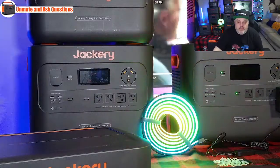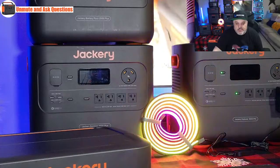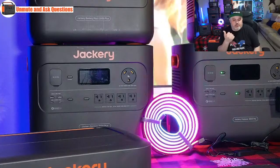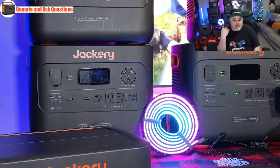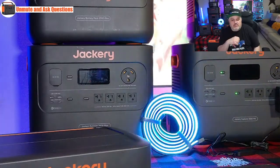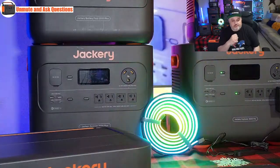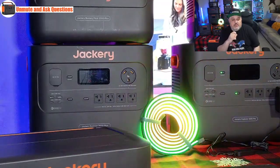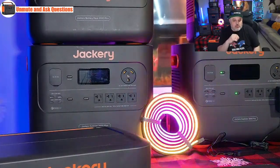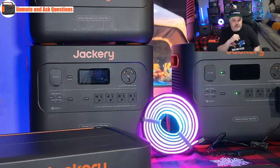Now, you can run the 1150 watt window AC. You can run your lawnmower. You can run a welding machine off of this. It can all be done with that. If you ever needed a CPAP machine or a breathing machine, 150 hours of runtime off of this device by itself. Your 520 watt refrigerator, about 3 hours of runtime. That means you can keep your food in your fridge cool until hopefully the power comes back on. Your 1100 watt microwave, that's going to only allow you to run about an hour and a half off of that, right? Your 200 watt all-in-one desktop PCs or your larger laptops, about 12 hours.